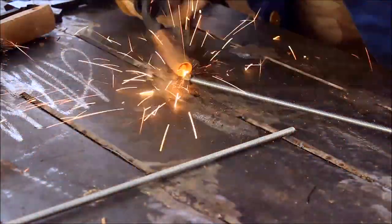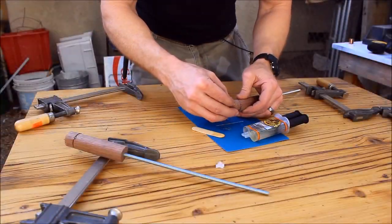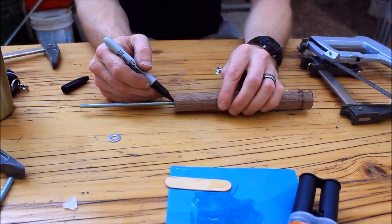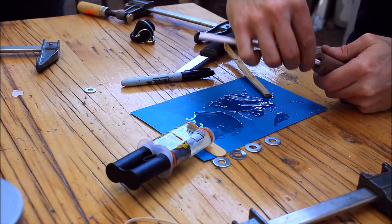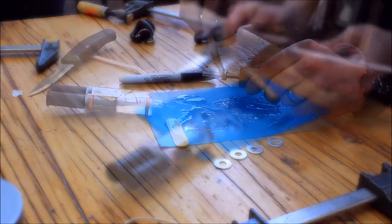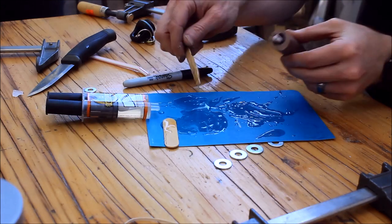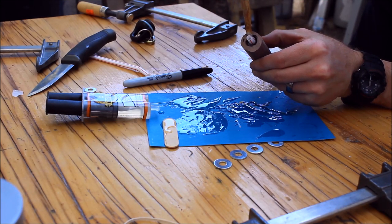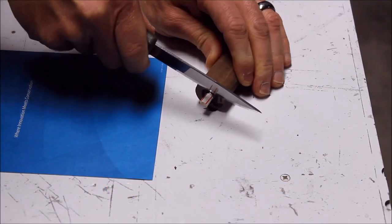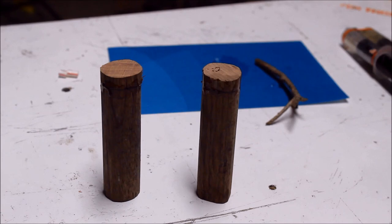I tack-welded the fixed side — if you don't have a cheap welder like this, something like JB Weld would probably do just fine. For the other side where the nut sits deep inside the handle, I didn't want the epoxy to get into the threaded area, so I used the extra threaded rod that was trimmed off and a straw to create a channel for it to go into. Once everything was dry, I trimmed off the plastic straw and then epoxied it all together.